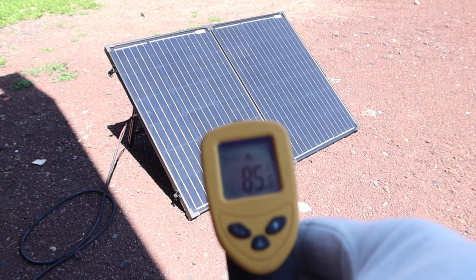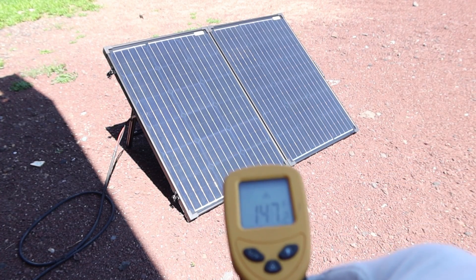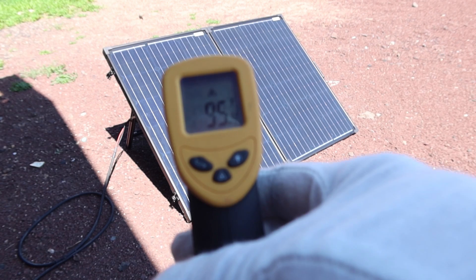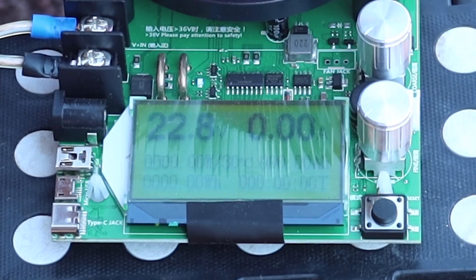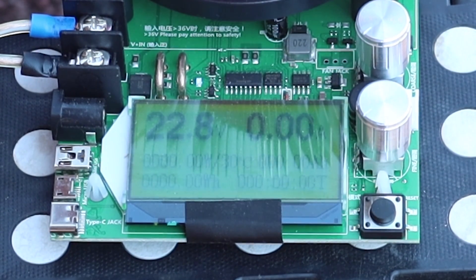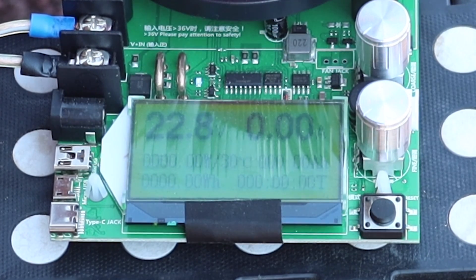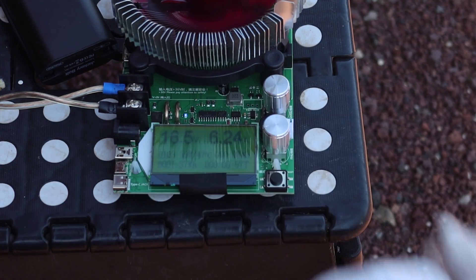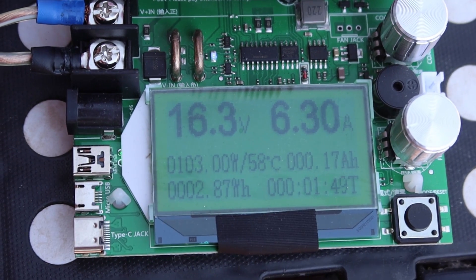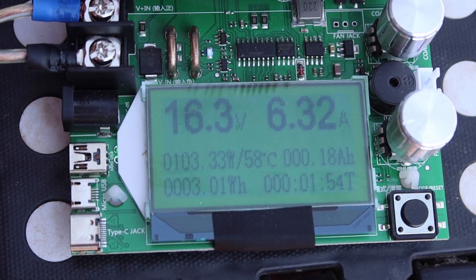The panel's only been in the sun for a few minutes. That's about ambient temperature — you can see the ground's a lot hotter, 150 degrees. The panels are slowly climbing: 94, 95 degrees, so we better get our testing started. Open circuit voltage is actually pretty nice — 22.8 volts. That's very good; that shows it's using quality panels. Let's see how many amps we can pull. We're at 103 watts, 104. So there's the official number: about 103–104 watts, 16.4 volts, around 6.3 amps. These results are actually pretty good.